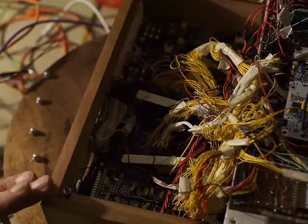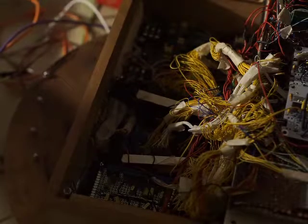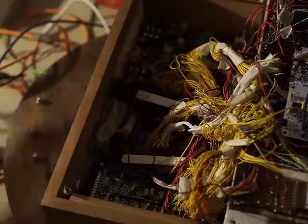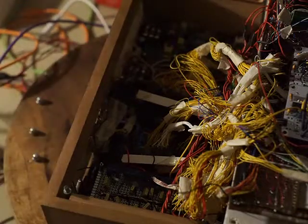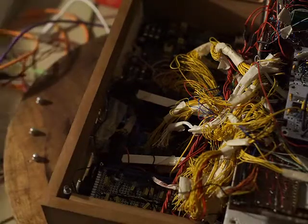This worked very well with a LED transformer, which has a ground input. So it's important that it has a ground input to minimize noise from the circuit, because otherwise, if it's not ground connected, there can be some problems, because all this pull down needs a proper ground connection.